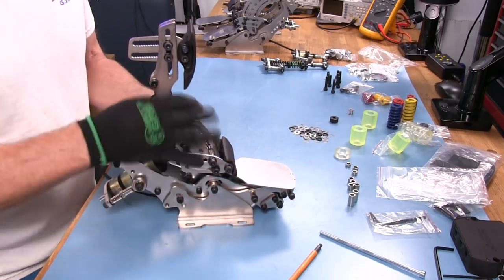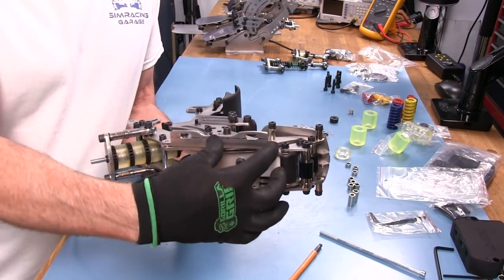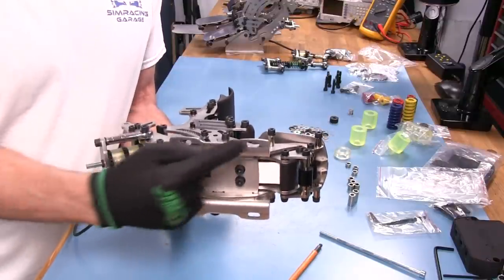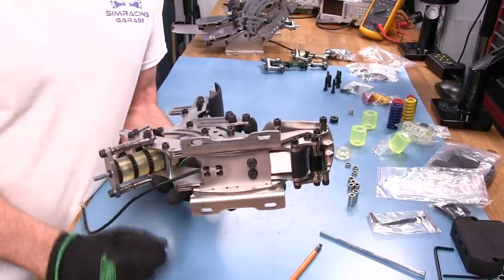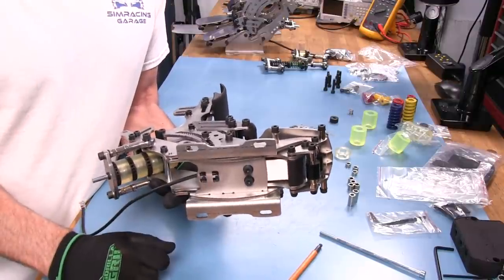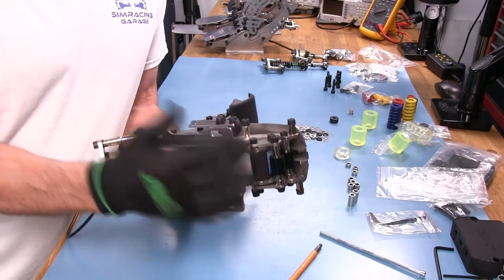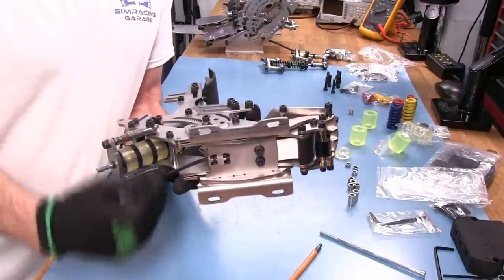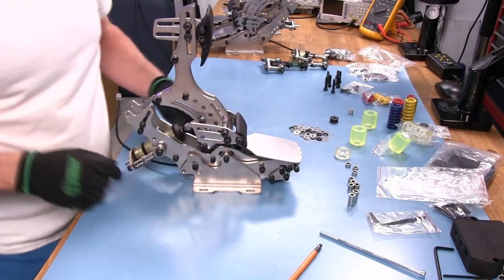This pedal was designed to be mounted to a 4120 profile, or maybe two 40 profiles, two separate pieces, because a 4080 won't fit because the spacing here is not compatible with that. But it is compatible with a 120 or two separate 40 series. Or you can just mount it flat to something. But because of that design, you would have it mounted to a profile like that, there would be room or air underneath. But if you had something flat like this you were mounted to, that would be a concern.